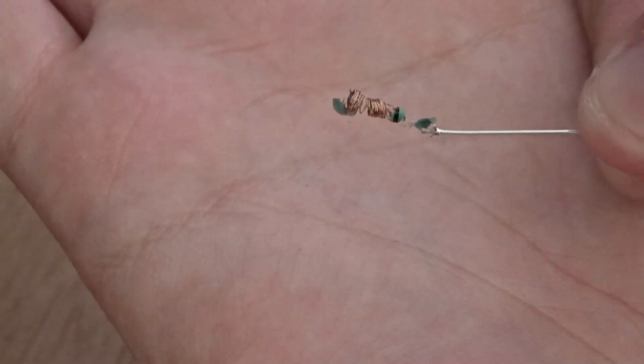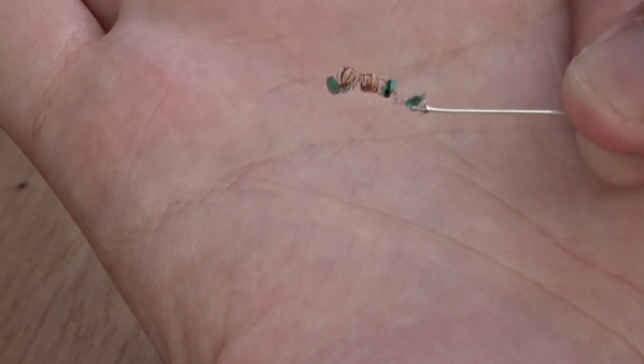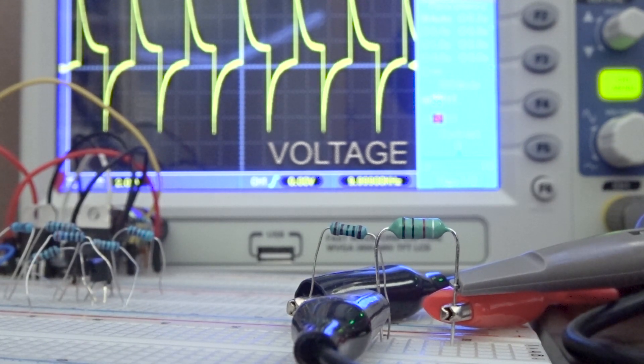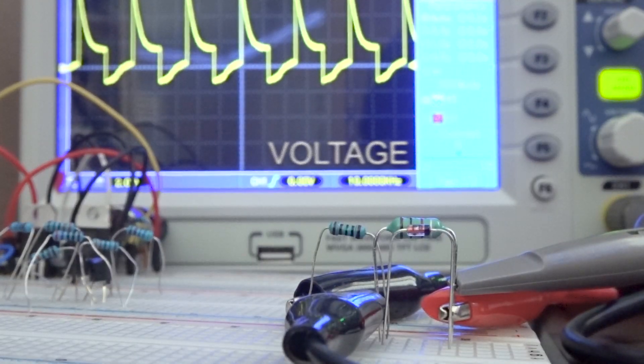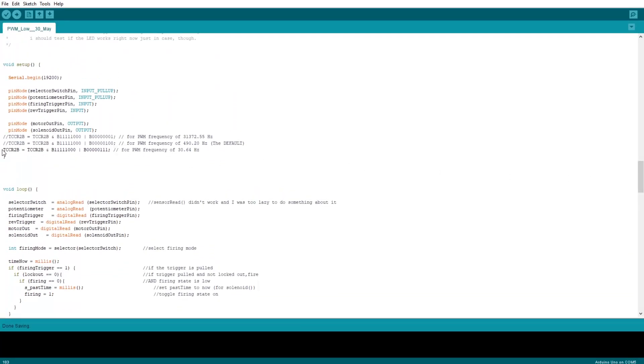Internally, motors are made up of coils. Depending on how coily these motors are, they can induce a voltage that acts against the changing current. What this means is that when we cut off the voltage supply, we end up making a negative voltage spike. Combine that with PWM and you end up with huge voltage spikes thousands of times a second. The solution is as simple as giving the current somewhere to go using what's called a snubber diode — we're effectively giving current generated by that negative voltage a path to flow through. As added security, we're also lowering the PWM frequency, which is literally just going to be one line of code.